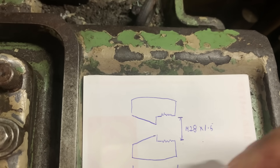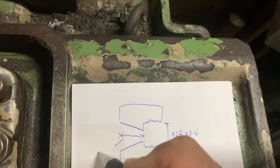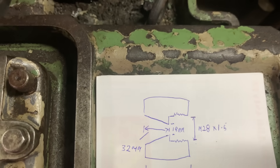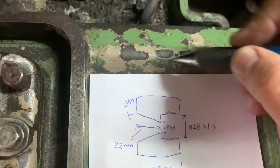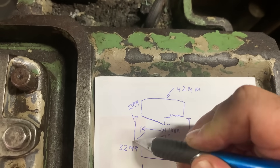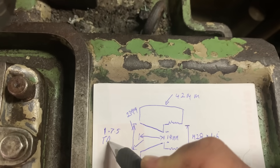This is going to turn at about 20,000 RPM, so it needs to be turned in a single setup to prevent runout and vibration. While the thread is easy enough to do facing away from the chuck, and it's easy enough to set up the taper angle before starting with the top slide, the difficult part is setting the taper diameter — you can't measure it until you take the part out, blue it up, and try it against your spindle shaft. If it's wrong, you can't put it back in and turn more; you'll never get the concentricity back.